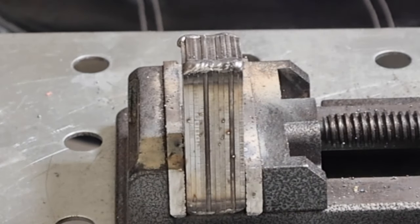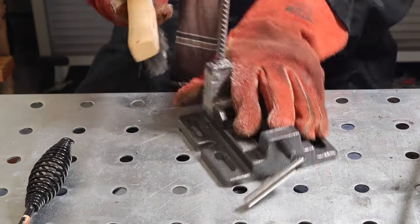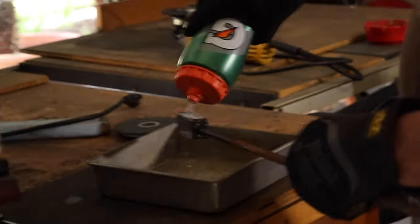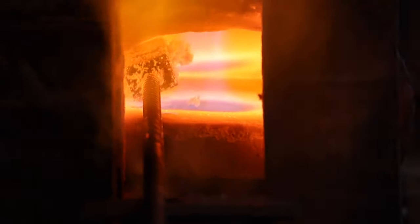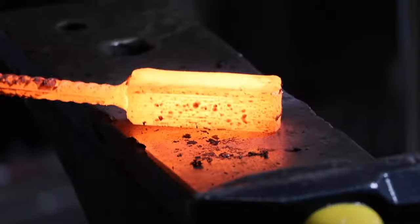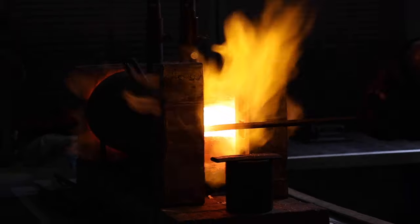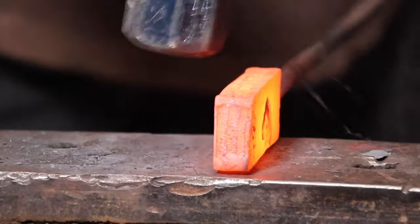I just ran welds right on the corners of the billet. This first attempt was all 1/16th inch thick steel, which turned out to be too thin on the outer edges. I welded up a piece of rebar for my handle, soaked it in kerosene, put some borax flux on the billet, put it in the forge, and let it heat up to forge weld temp. I could see on this first attempt, as the billet was heating up, the outer layer of 1/16th inch thick steel started to peel up a little bit.